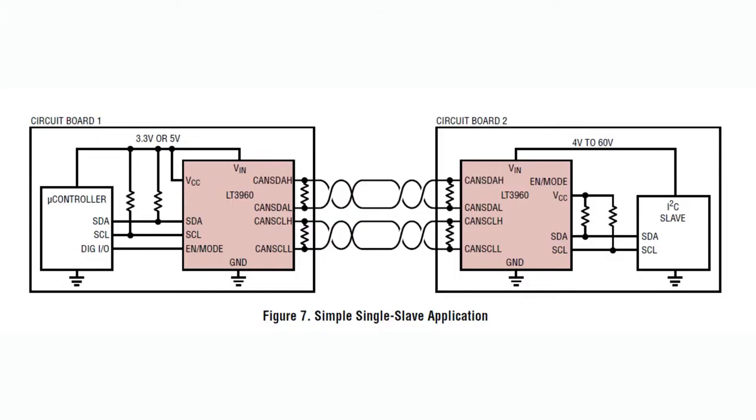I2C is meant to be on a single circuit board. However, nowadays there are so many sensors and devices that might be remote — you might have a temperature sensor, a humidity sensor, or a magnetic sensor in your robot or automation, and you might want it a little bit farther, connected by wires longer than a few inches, or maybe even longer than a meter. Or perhaps you have a lot of EMI because it's in a robot with motors everywhere. I2C is a single-ended physical protocol: you have a ground, a clock line, and a data line. It's non-differential and designed to be simple, since it's meant to be in a circuit.